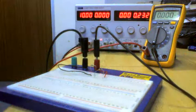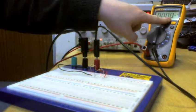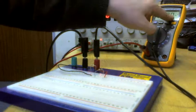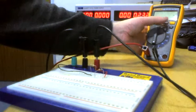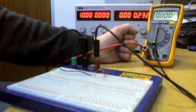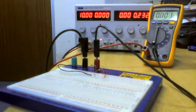Switch power on — and immediately you can see a problem. It's only oscillating around the last digit, between 0 and 1. Nowhere near 0.4 milliamps — it's actually only measuring down to the milliamp. We can change the range if we want, range it down even further, but it doesn't make the slightest bit of difference. The current flowing in this circuit is below the range of what this multimeter can actually measure.